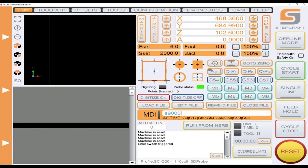After about 5 minutes has passed, we're going to go back down to our MDI and change our speed S to the max 18,000 RPMs. Hit enter again, and you can do this with the spindle already on — it should ramp up its speed to 18,000 max RPMs.